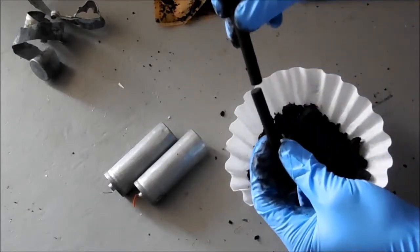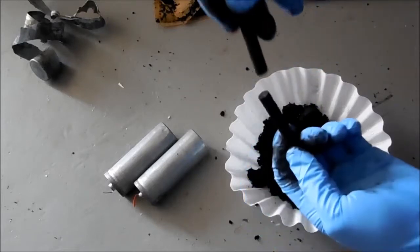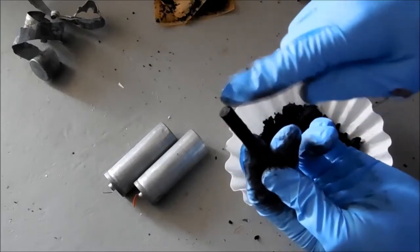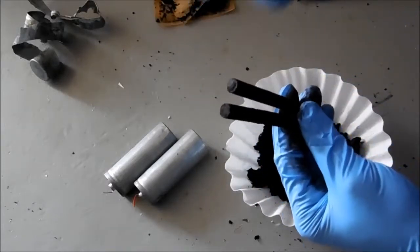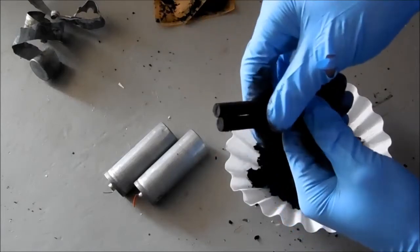What I was saying about the spot welder — in your little assembly there, you can use these electrodes. You can cut off some of it so it's more of a point. And if you use copper electrodes, they'll wear down. But since the carbon can withstand lots and lots of heat, these will last a lot longer.